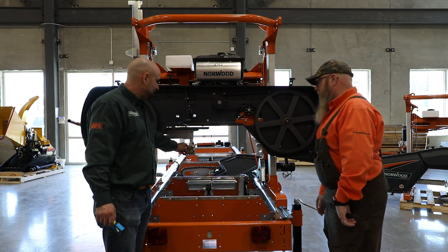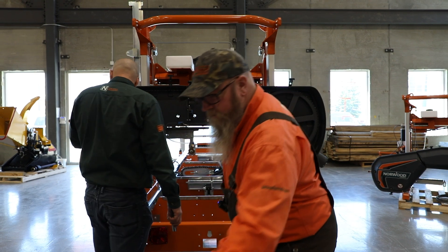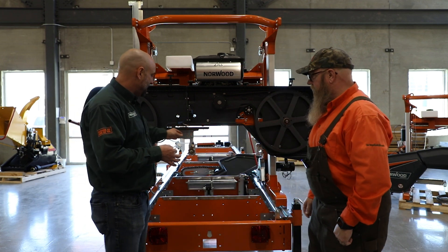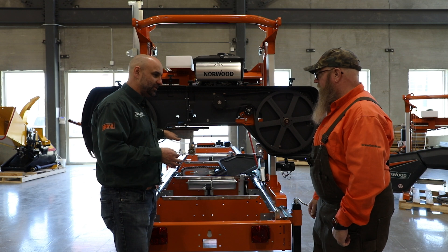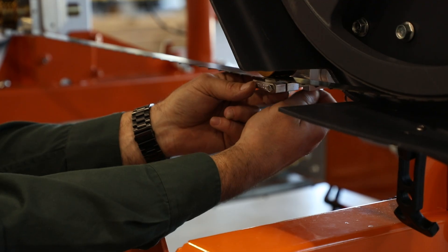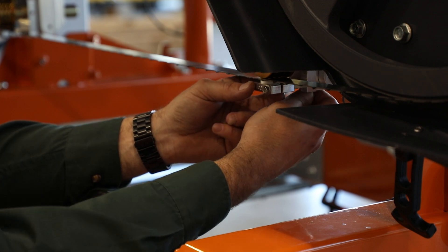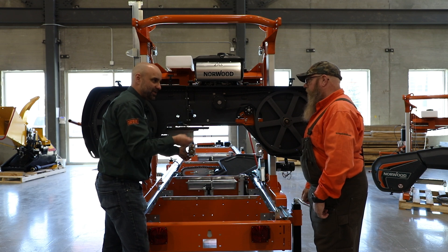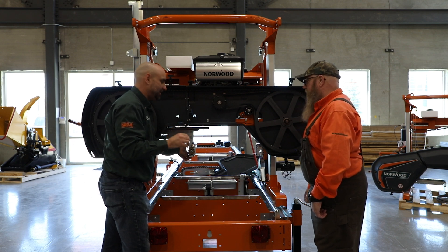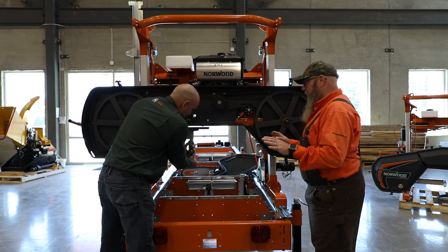There are three really easy-to-set-up settings that are crucial for your best sawing experience. Now one other piece to this new unit is this lower ceramic. So now we have the roller pushing down on the blade, controlling it, controlling the lead of the blade — and then we have this ceramic. It goes on underneath the roller. When we slide it in there, we now have a ceramic pad underneath the blade, which also helps control the blade. If the blade hits something and wants to deflect down, we've got the ceramic giving us a little more stability. So we're still trapping it, but we're controlling it, then trapping it.